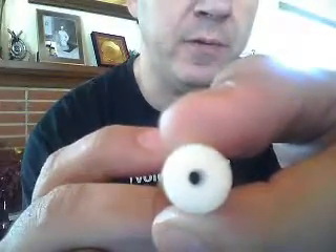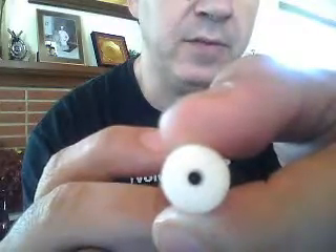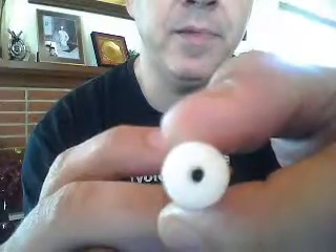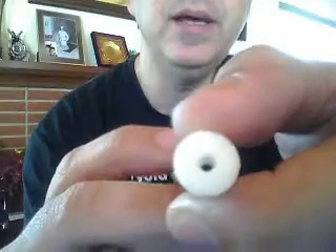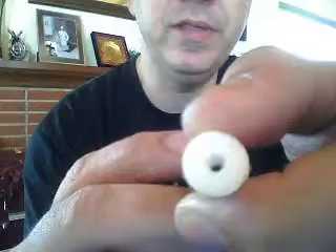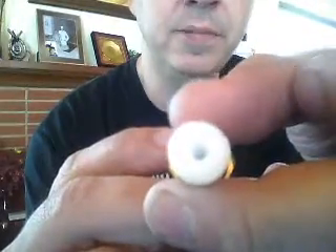Down at the very bottom of the rod, the hole is not 4mm — it's actually 3mm. I heat up the hotend and drill that last bit out even after I assemble it, because the PTFE tends to squish in there and it actually makes the hole very, very small. And that tends to bind the filament.